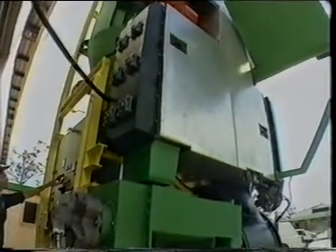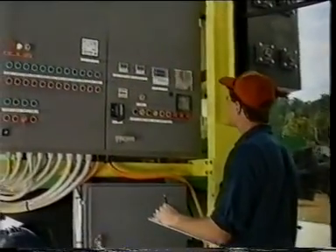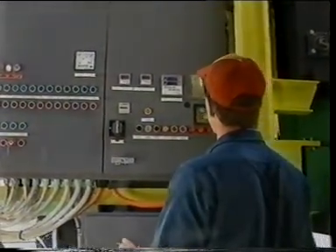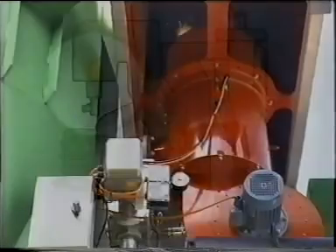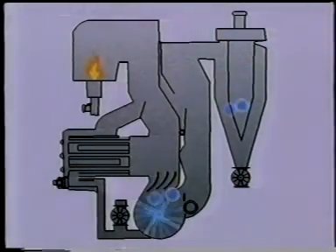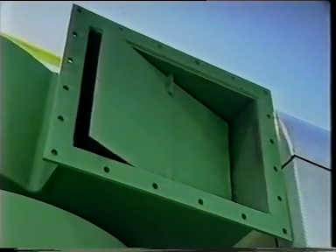The Kix is a very efficient industrial dehydrator operating on gas, distillate, or other oils. It uses no steam, so there's no need for boilers. The burner produces the heat necessary to drive the moisture from the material. The exhaust fan generates the airflow which carries the material through the dehydrator in a continuous stream. An adjustable exhaust damper controls this.